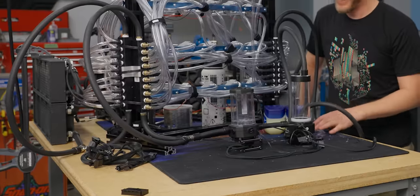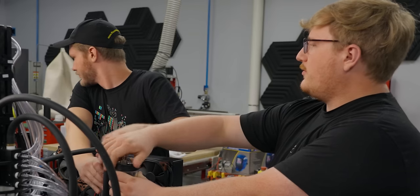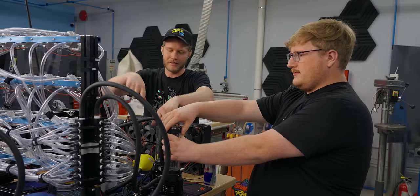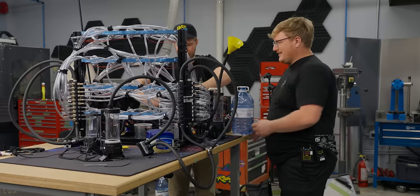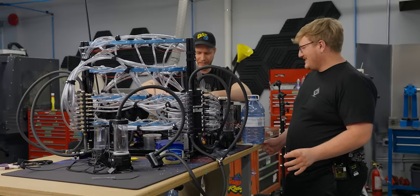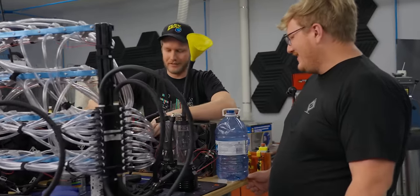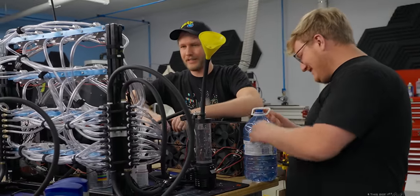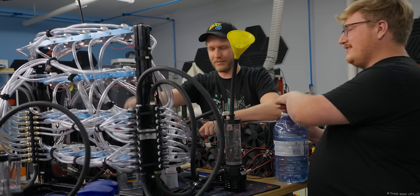This might be the most Alex thing I have ever seen — so beautiful. We fill it now. This side is water, that side is antifreeze for the hot side. There's a separate power supply just for the fans and the pumps so we can independently turn them on, and if the coolant gets too hot or too cold we can turn the Peltiers off. All the fans are connected together using 10-fan splitters into two Molex connectors.